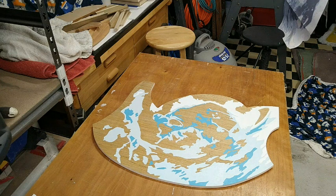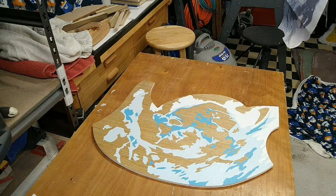The thing I want to show you is how I figured out to at least initially do curved frames. It's not the end point, because I'm going to go further with this. Normally, to make really interesting curves, you have to do lamination — a bunch of thin strips of wood glued up against a form so you can get really complicated curves. I couldn't quite get there with this, because I don't have any way to do lamination yet. I'll be working on that shortly.